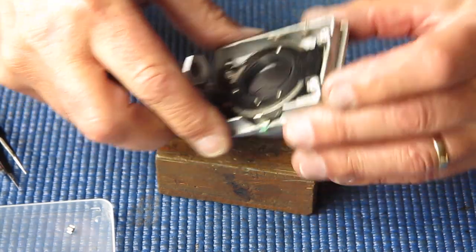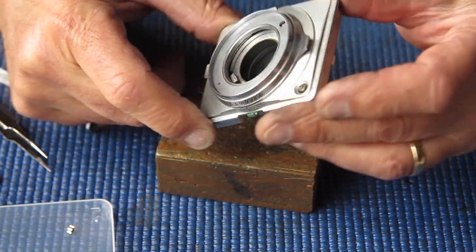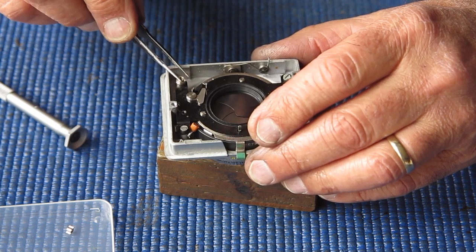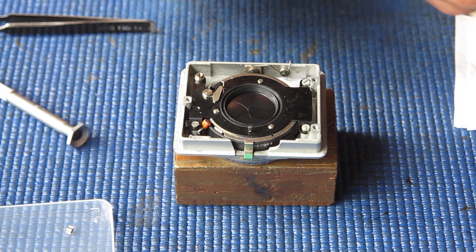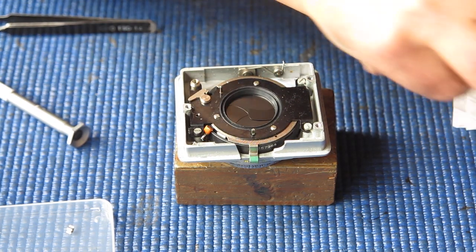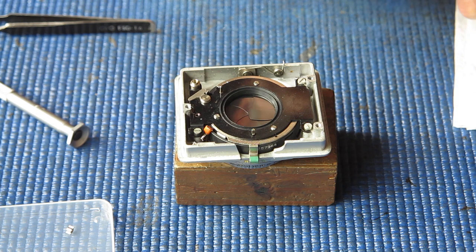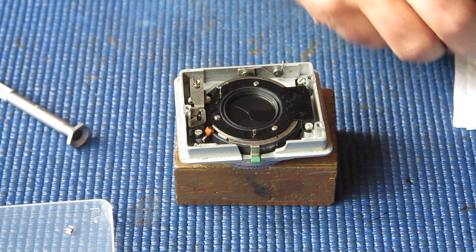Screw those three screws up lightly, flip it over. I want to make sure that this aluminium shield in the middle is sitting correctly. It is, that's good. Yeah, that standoff goes there. Yeah, shutter release lever. Just run a little bit of molybdenum paste down this. Make sure there's a spot on there where these things connect to each other. That's good.